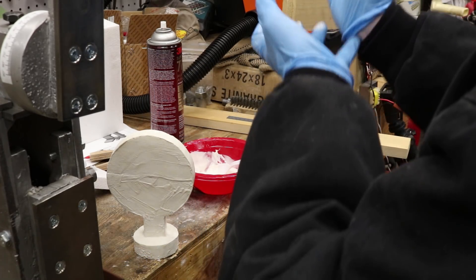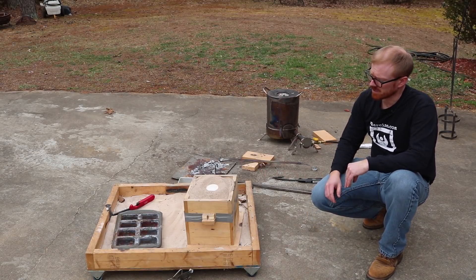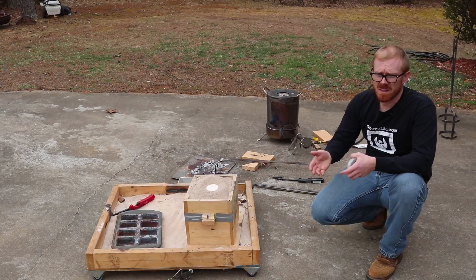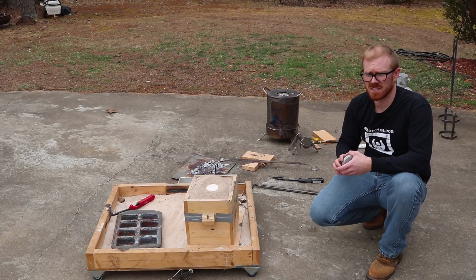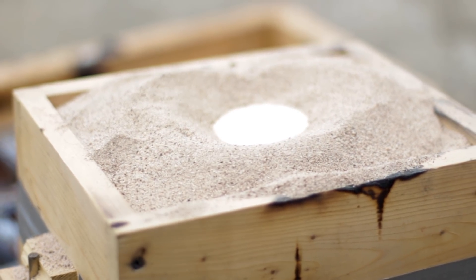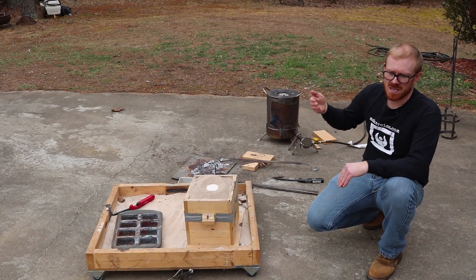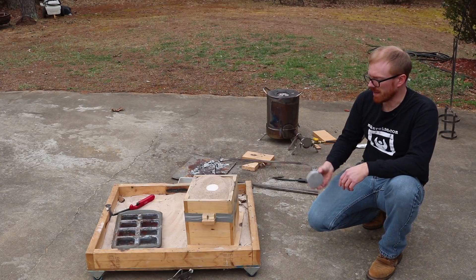It's in the foam, it's in the sand, it's got the refractory coating on it, so I'll be casting that here shortly. After I get this part cast, I'll take it over to the lathe, bore it, face off one side, then put it on an arbor to turn the outside and face off the other side. After I've got it fastened to the face plate, I can reduce the little shoulder so that it mates well with the chuck. So then I should have a chuck — hopefully this will work out.